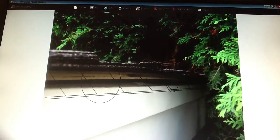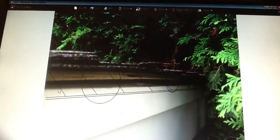My crews always took the felt, laid it over the top of this, tacked it down into here. Always cut it later. Put down the metal, the 2 by 2 or 1.5 by 1.5 by 10 foot. Nail it into the deck up here. And it's tied up against whichever board you have here. And then you do all that prior to the shingles being installed.